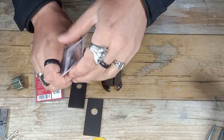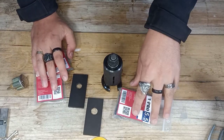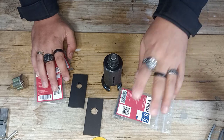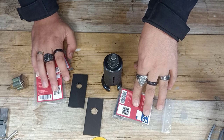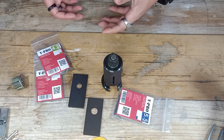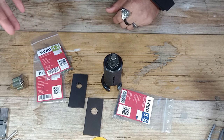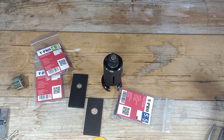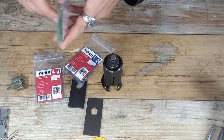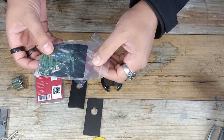You get different sizes depending on what size core you're attacking. Now one of the questions is, because these screws are so high quality and really well made, they're going to be a little bit more expensive than your standard screws. One of the things people ask is: can they be used more than once? Yes. Most of the time you can use these screws more than once. If you can remove them from the core, you can reuse that screw again in another lock. They're going to wear down, get metal fatigue, and at some stage they will break, but you might get three or four cores pulled with one screw, saving you a bit of money. These are fantastic screws and a must-have if you've got one of these units. They come with a little Torx bit because these are Torx heads, not your standard screw tips.